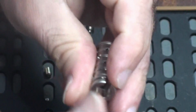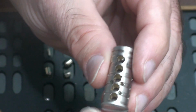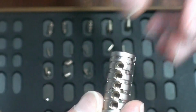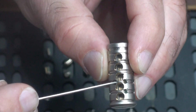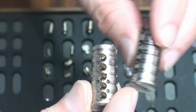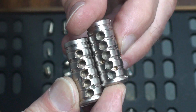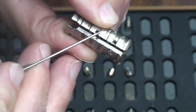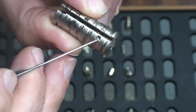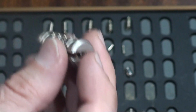And then I looked, once I picked it, I got this side apart and discovered that it has in fact 3 anti-drill bars there. You'll see that this one has only got room for 2, interestingly, and we've got a couple of other bits of anti-drill protection down here, and a captive ball bearing down there as well. So there is actually plenty of anti-drill protection in this lock, which I think is bloody good.